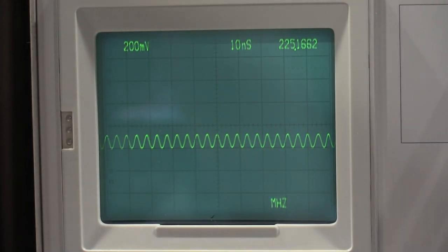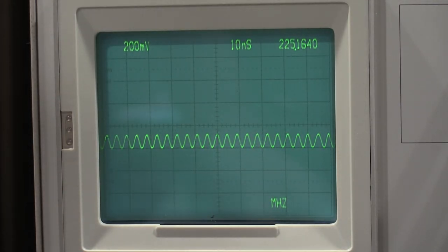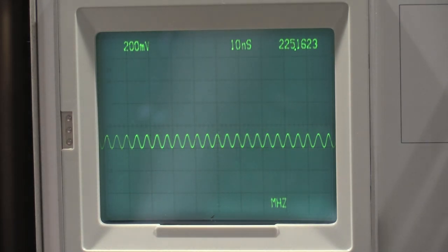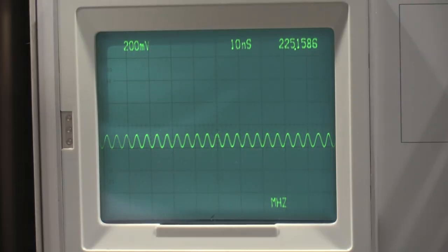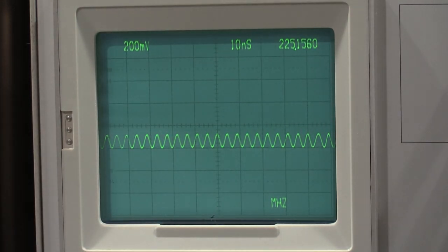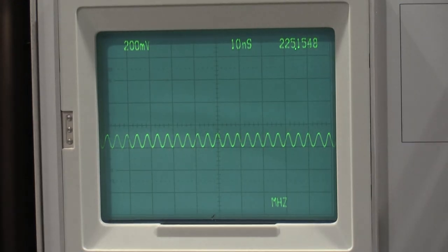There was two steps in there that I had to skip because I do not actually have a measured 10 nanosecond delay line in the lab. That is something I will work on. However, to the limits that I can test it, this 7D15 appears to be working. I also don't have any of the SMB connectors, so I couldn't test those as well. But it is up and going.